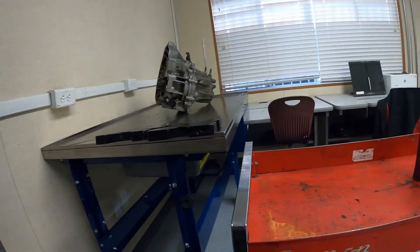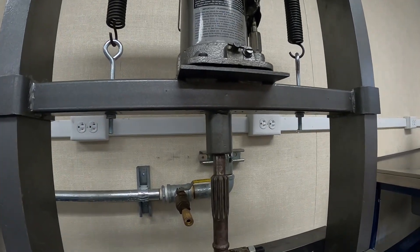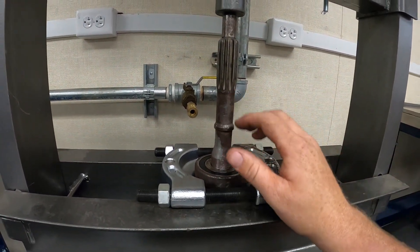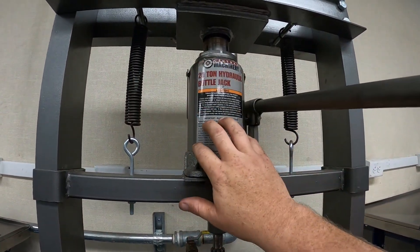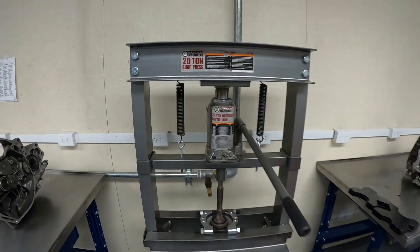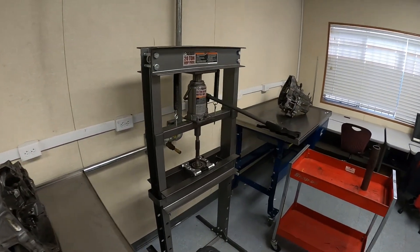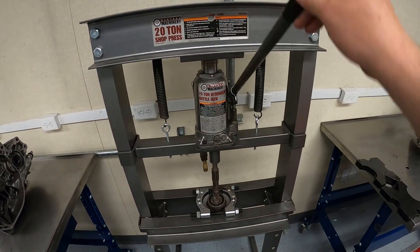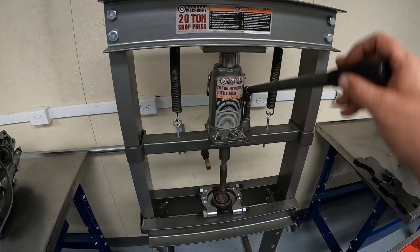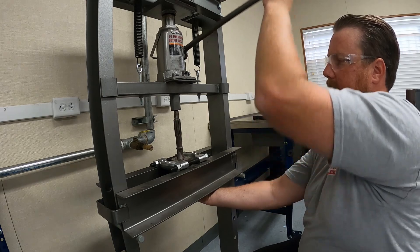I'm going to come in contact with it, grab the lever - again this is just like a floor jack lever - and start to apply some pressure. Those little clicks are normal, that's just the bearing starting to move on the input shaft. This hydraulic press doesn't have a gauge for the hydraulic ram, so we really don't know how much pressure is going into it. It's important to be watching the frame of the press - step back and see if it's starting to buckle or move. If it takes a lot of effort to press down on the lever, you probably need to stop and reassess. But right now we can see we're going down pretty easy. All those cracks and creaks and noises you're hearing are completely normal.